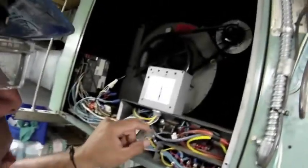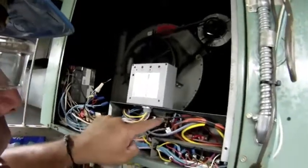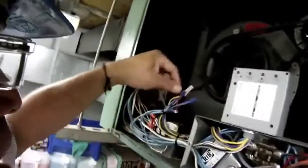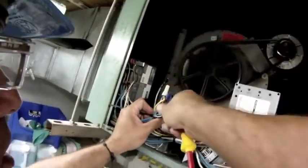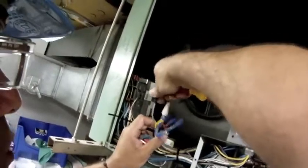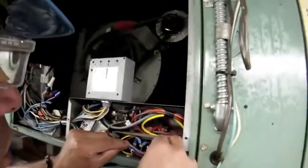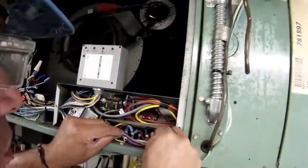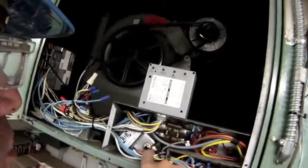And as I'm looking at all my wiring connections, everything looks really good here so far. The contactor is in good shape. None of the wires that I took apart and put back together have fallen off. All my twist connectors are in good shape, and everything is nice and tight on the controller. That's where I did most of my activity. Also right in here, everything's still very nice and tight, nothing loose, nothing coming apart, and so I'm pretty happy with that.